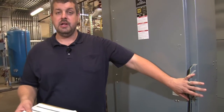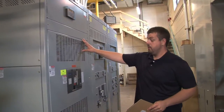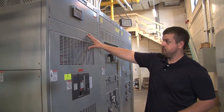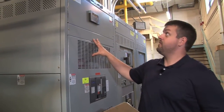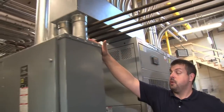At this point in the project, the whole system is shut down — we can see at the main switch that this system is off, so nothing is running. This switch gets its power from the main service equipment; here we have the main breaker for the service for the school. Located on the top side is the supply side of this switch, so the conductors attached here are from the transformer supplied by the utility. From there, these supply-side connected service conductors go across this box and through these short pipe stubs.